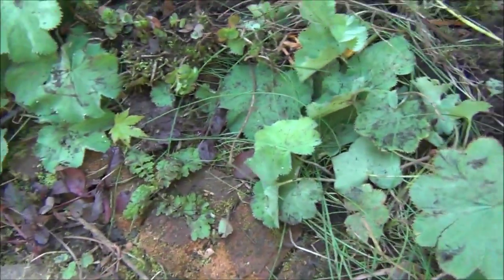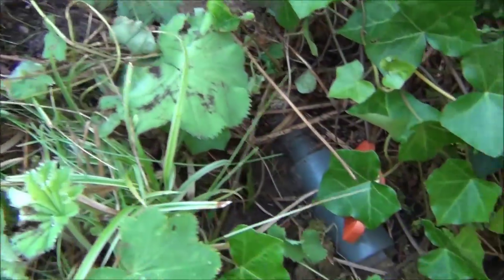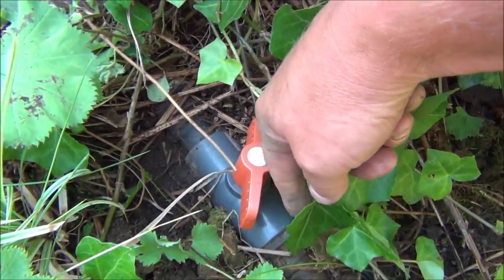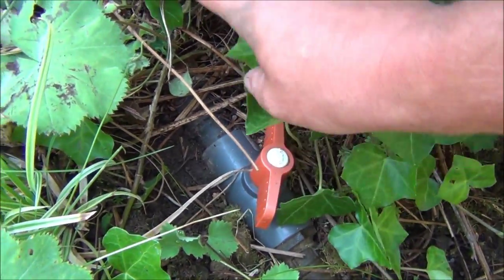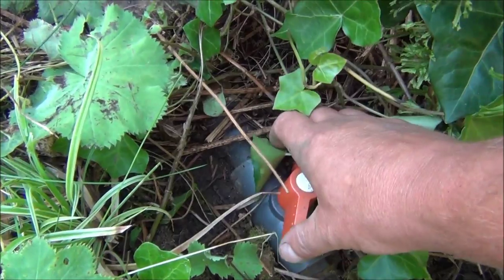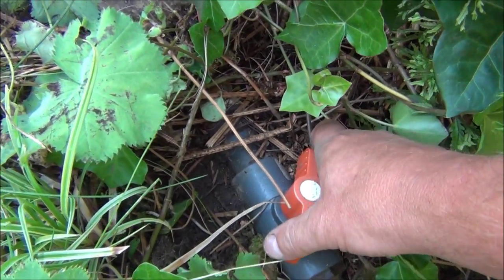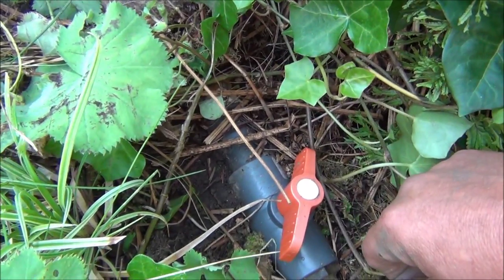We didn't alter any of the pipework, and where the pump feeds out, it feeds into a T-piece up here, one side of which goes to one urn and the other one goes to the filter. So by altering the lower one, i.e. by restricting it, you can get the flow perfect between the two urns.